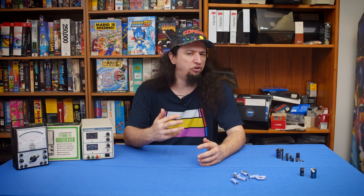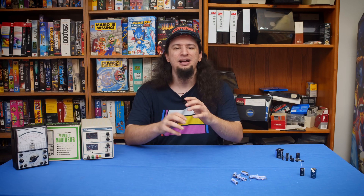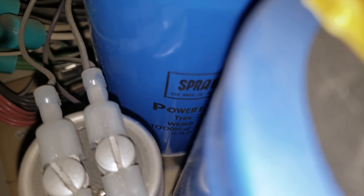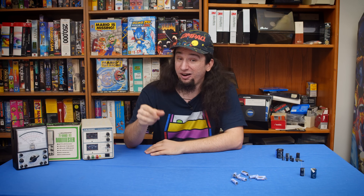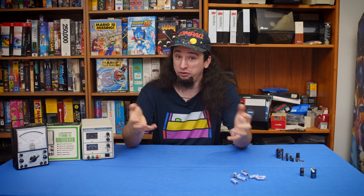When it is worth reforming a device and its capacitors is not a firm rule, but I would say it's worth considering when the potential energy of the capacitor approaches one joule. Here's a prime candidate — a 100,000 microfarad, 10 volt monster. Its lower voltage means the oxide layer was thinner to begin with, and the massive capacitance means it has a large surface area which increases the likelihood for failure. It also clocks in at potentially 5 joules.